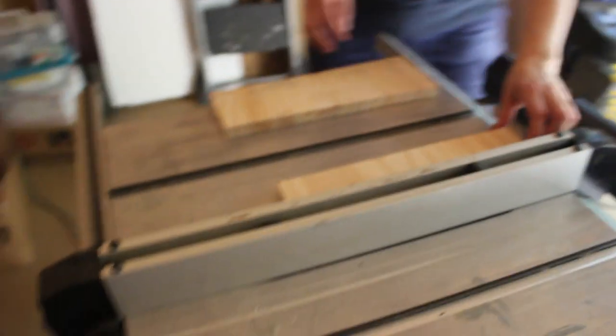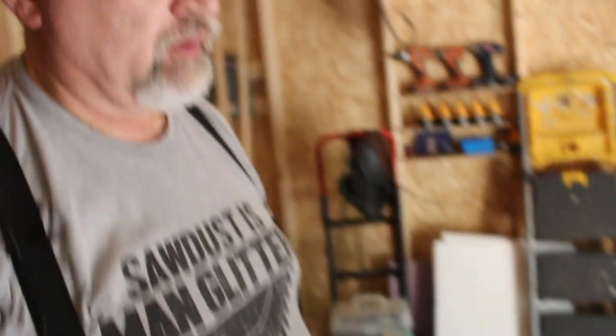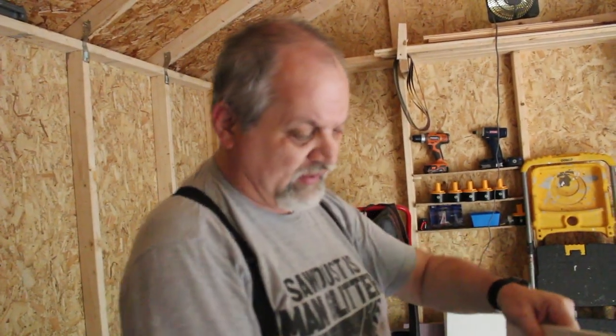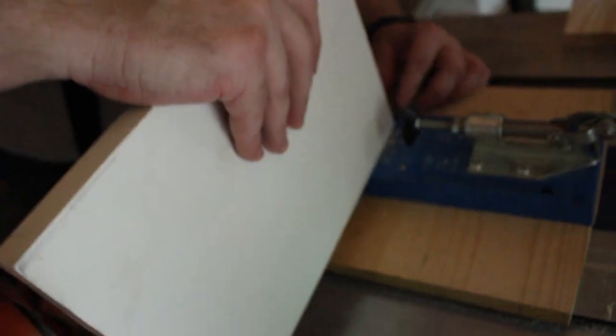It's very convenient, look, it broke. So we won't have to cut it. Yeah. Very nice of the wood. Love it. So we're using pocket screws close to the edge because we know we have lumber there. Because it's a corner, and then there is a window which has casing around it. Right. So again, the only thing that you need to remember here is you need to make your screws on the same side, right? The pocket holes on the pocket hole, yeah.